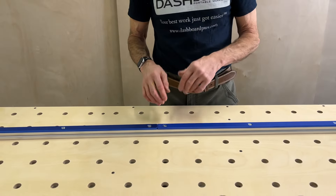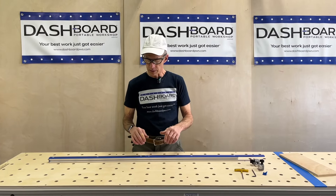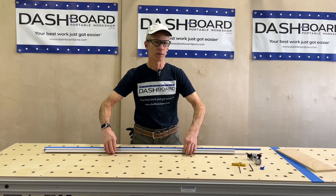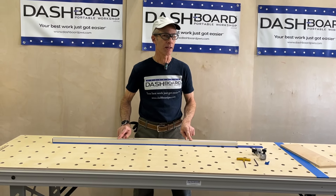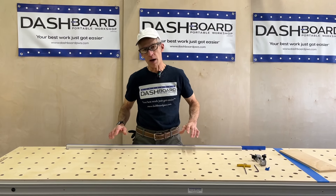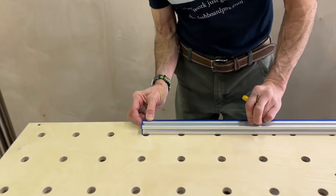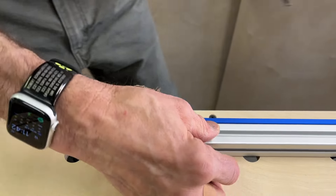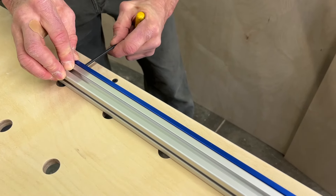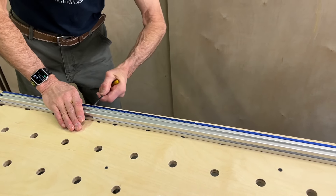In order to make sure that the working face of the fence — the one that faces you when you're working — is in plane with the base bar, we're going to put that face down, because it's going to look like this when you're working on it. So I want to put that down before I tighten the hardware. I'm down on a nice flat surface. Take my wrench and we'll start with the short one — just even it up with the end cap. Making sure that both pieces are flat against the surface, tighten that screw, tighten this screw, and the other.